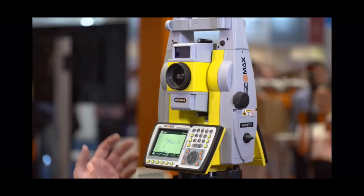The Zoom70 is the perfect instrument to start into the robotic surveying. The new innovative GeoTrail functionality finds the prism based on the GNSS position that is transferred from the controller which is mounted on the pole towards the total station. Once the prism is found, the tracking technology takes over and follows your prism even if it's fast moving. And finally, the AIM technology is performing a fine search and triggers the measurement very reliably, very precisely and very quickly. So the combination of all these technologies and sensors is very smart and improves your efficiency day by day with every measurement in the field.